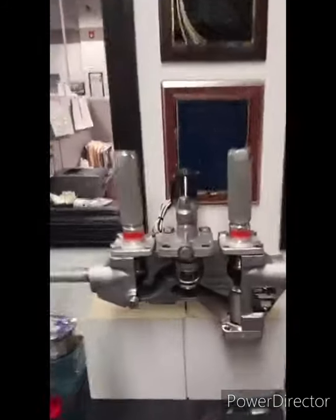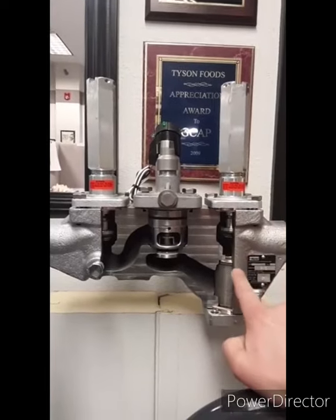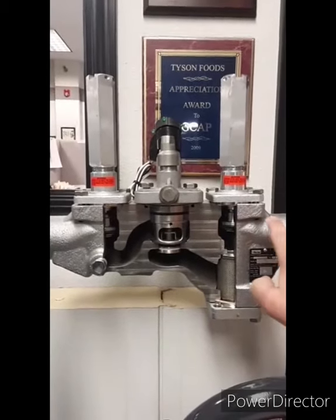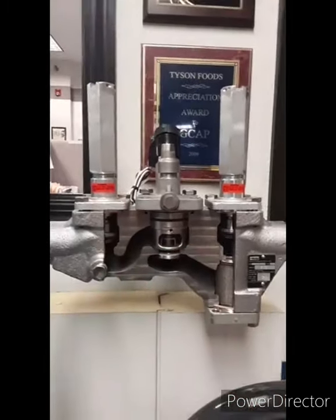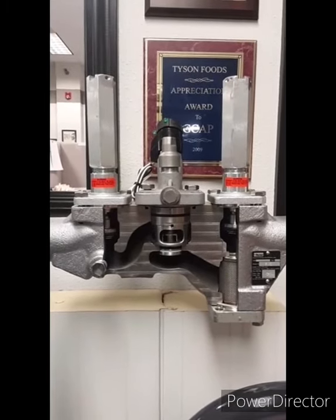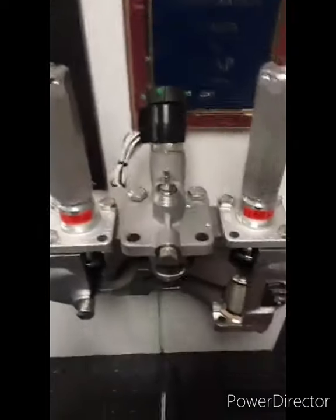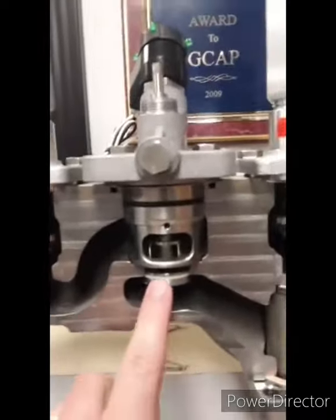Let's take a look at a cutaway we have here at the facility. It's a very nice display. The valve on the top right is our first isolation valve; underneath it is the strainer. After the strainer, we find the solenoid. So our flow would be moving from right to left — always from the strainer basket into the solenoid. Downstream of that port is most likely the hand expansion valve combination isolation valve. The solenoid right now is in automatic function, meaning whatever is controlling it electrically will actuate the valve. When energy is given to the coil creating a magnetic field, the magnetic field will drive this plunger downwards to create an opening force.